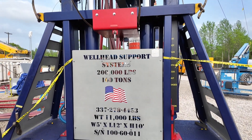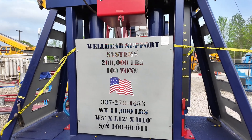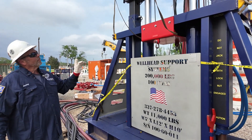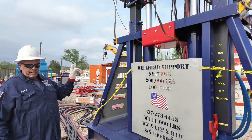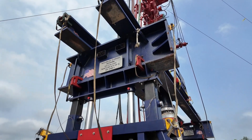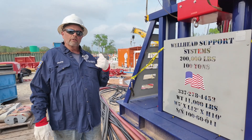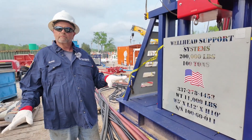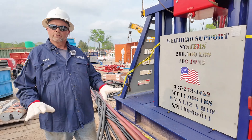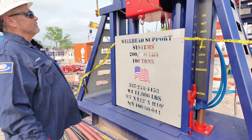Just tell us kind of what this thing does. Okay, we set one of our jacks on either side of the wellhead. Our capacity is possible to do up to a million pounds with the jacks. But our beams — the weakest link on there — is 800,000. That's on a 5,000 pound system; our power packs are down to around 3,500. So our maximum that we can actually do on a safe side is around 750 to 800,000 pounds, so we don't over-exceed anything that's not safe.